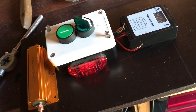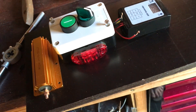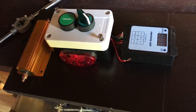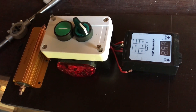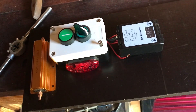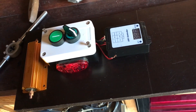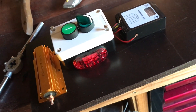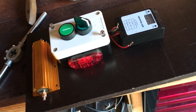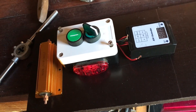I've decided to mount the pre-charge circuit on this board. It's very rarely used — it's only for maintenance — and if I need to use it on another system elsewhere I can take it over and use it there. It would clutter up the board too much really, it's running out of room. Sticking it next to the neutral link was going to look fairly crammed in, so this is probably the best option. Mount it on this board with a couple of fly leads with alligator clips — it's very low current so alligator clips should be fine. I'll go from the battery side over to the inverter side and then to the MPPT side.